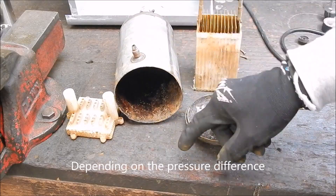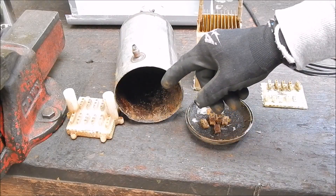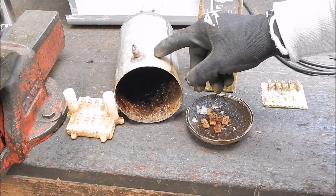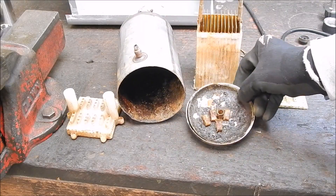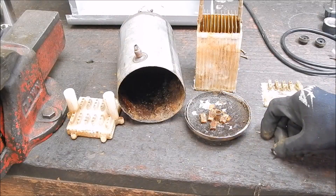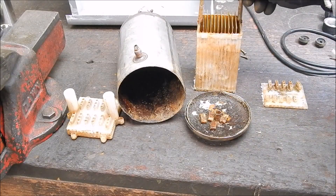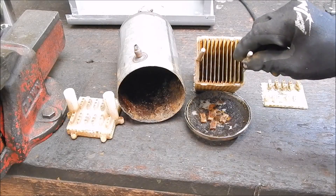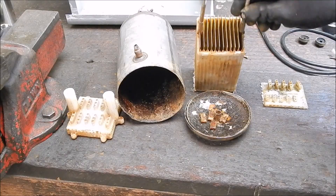The liquid can go either way — it can go from the electrolyte tank into the bubbler if you overfill it, or it can suck back from the bubbler into the tank. Generally it fills up the bubbler, in which case that wouldn't be a major cause of pollution. I had been putting borax in there as recommended by a jeweller, and I think the borax is what's caused all this pollution. What it comes down to is it's not serviceable — if it gets clogged up or dirty, you can't clean it, and it's basically a throwaway item.